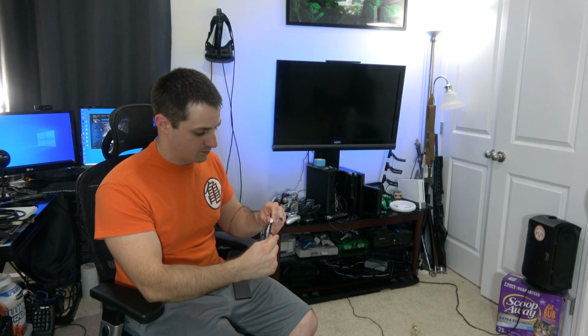Really, it's just a matter of extending these little wires out. It's really simple. It's almost universal, where they just plug in on the end. Just make sure that if you buy a 12 volt RGB, you use 12 volt wires, and buy more 12 volt RGB to hook up to it, because you can't hook up 5 volt to 12 volt.